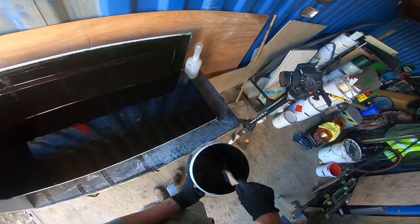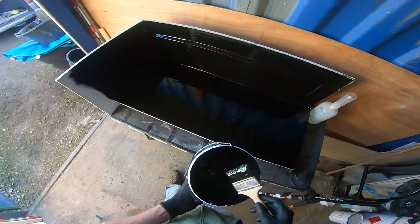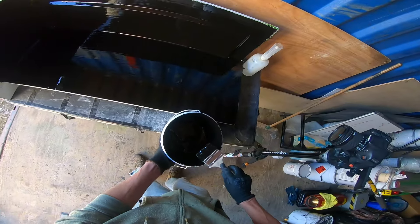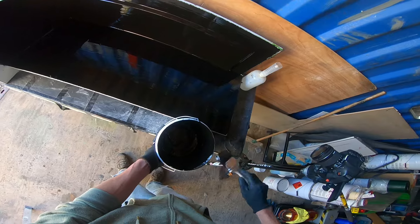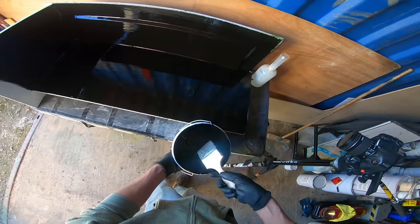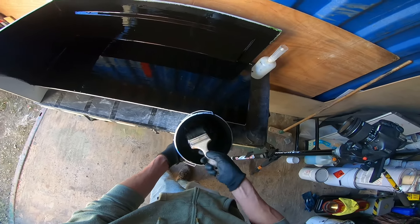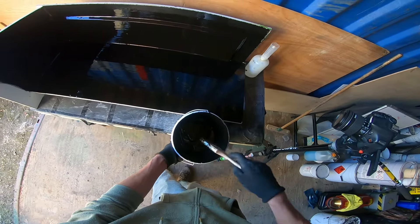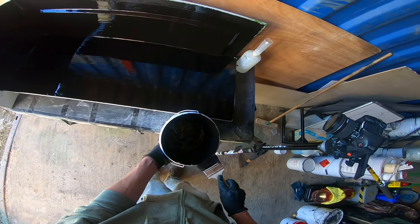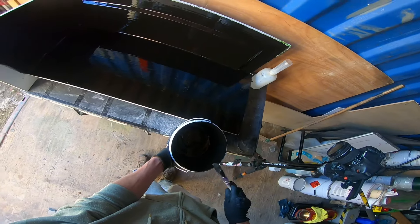Just put it down on the floor, and the vapour that does come out of that will be at floor level rather than up on a bench going straight up your nose when you're not wearing your mask. So that is the gel coat done. The reason behind laying it off into the bucket like that - when this gel coat has gone off in the bucket and on the job, I can crack this out and lift it out, or pour resin into that once it's all gone back down to ambient temperature and use the bucket maybe two or three times.